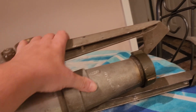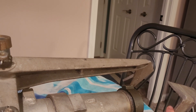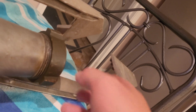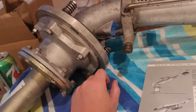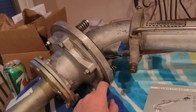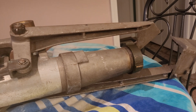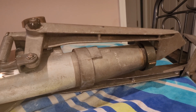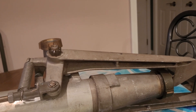This is a fast reverse design, a little different from the others. This one has a deflector on the top. The drive arm moves up and down, and when it hits that vane drive spoon it will go left, just like all the other guns. When it hits the stop — this one doesn't have the stops, but basically when the gun hits the stop it will bend, pulling this down. Once it gets pulled down it'll hit that, creating energy pushing it off to the right, which reverses the gun back.